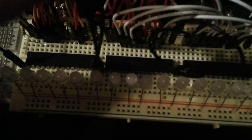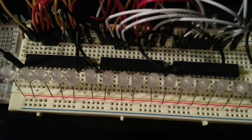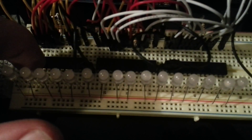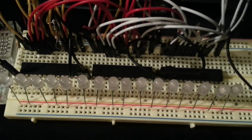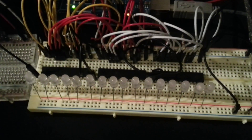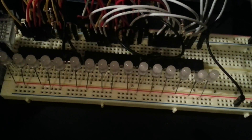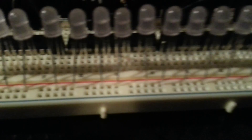What I got were three TLC5940NT chips from Texas Instruments. Each of these chips has 16 channels of PWM outputs, so altogether I've got 48 outputs I can use. Now it may not look like much — that's because these LEDs are all RGB LEDs, so they have red, green, and blue lights in each bulb. You can see on the back side all the pins going down; each of those pins is a different output channel.